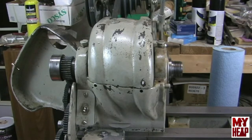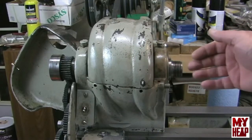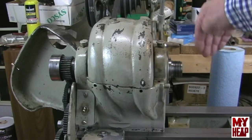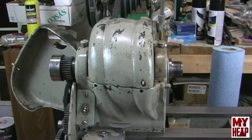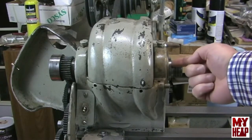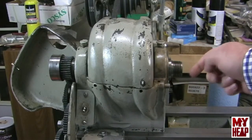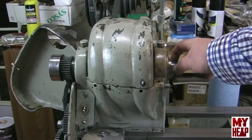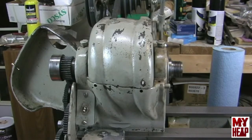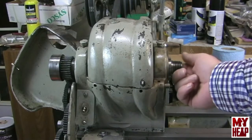So what I want to do is measure and see if I have any spindle end play — does the spindle move axially? Does it move off its axis in any way? And then the spindle face right here where the chuck would seat up against — I want to know if there's any runout there.